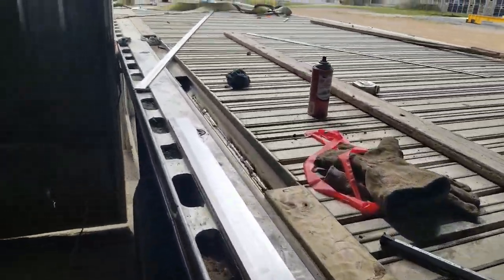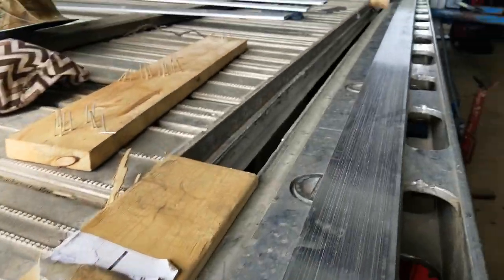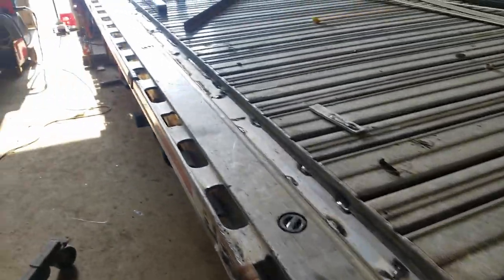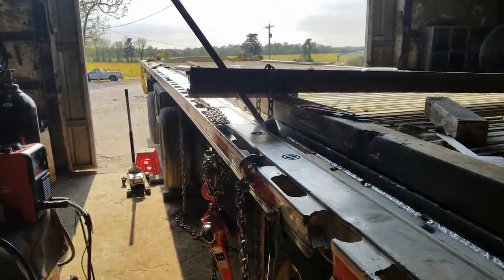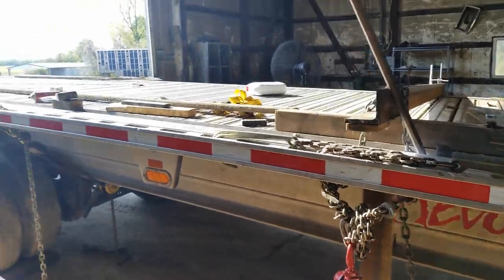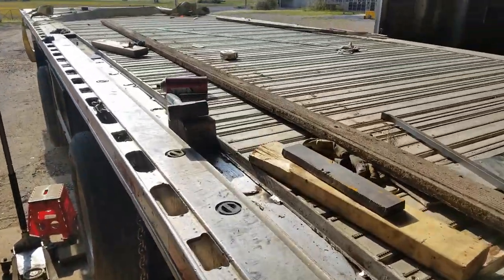All right, take a close look at this here. Here we're like 80% back together. Everything is lined up, squared up, put back, straightened out, under tension, welded back in place, and relief cuts where they were needed. So to minimize the tension, everything is bent back in place, and then relief cuts are made again to make sure everything fits perfectly.